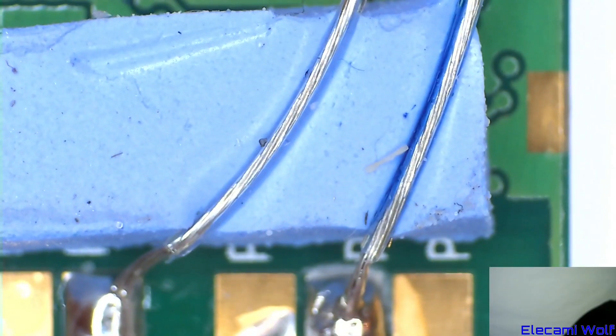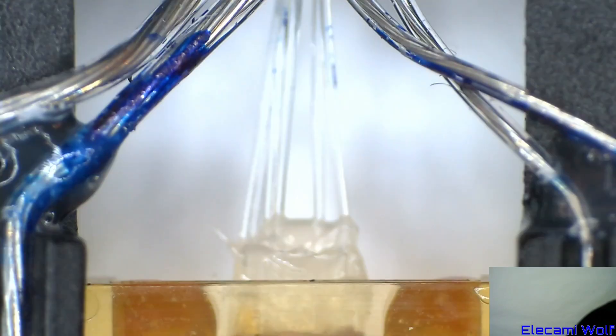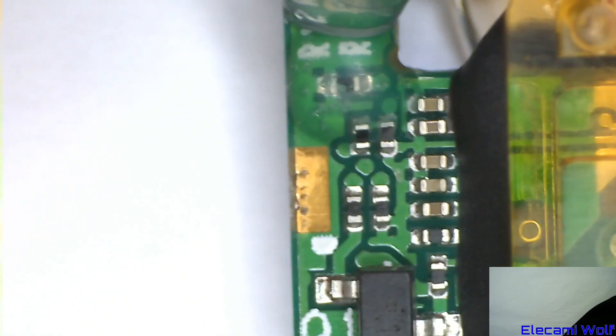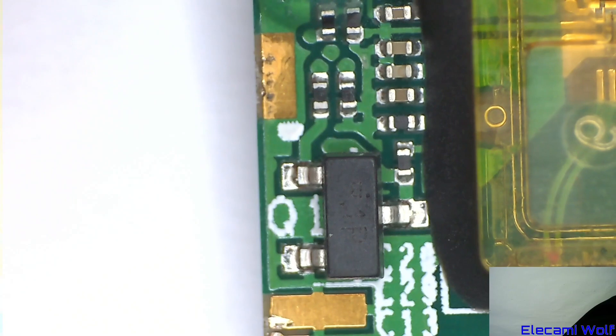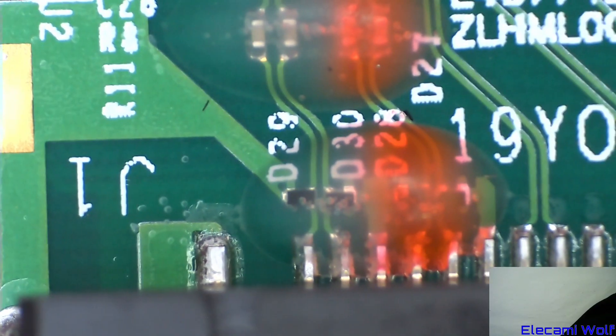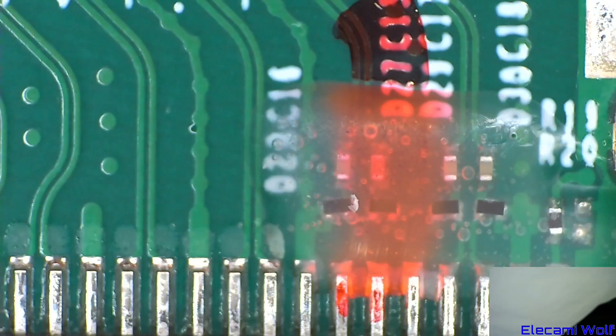Those wires there are thinner — those are for the high voltage — than these wires over here which are for the 13 volts. That's glued in position. They marked the positive sides with blue and the other ones are not marked. There's some support circuitry around the edges — bypassing capacitors — and there are a couple of other logic things I haven't looked up. It says 'one P' on it. I wonder if that may be a small linear regulator; it does look like it has resistors joining to it, or perhaps it's a transistor. There are some clamp diodes I think under there — D designators going to the ground plane — and then some coupling capacitors. And that is the same at the other end of the cable: clamps and coupling capacitors.